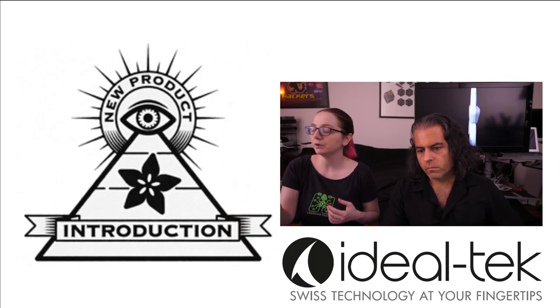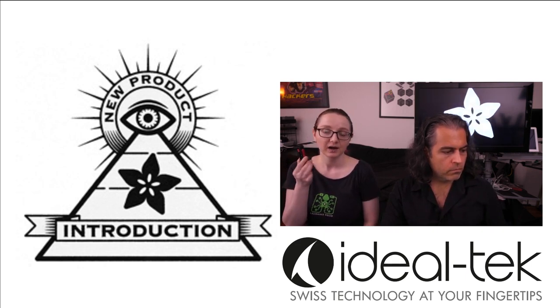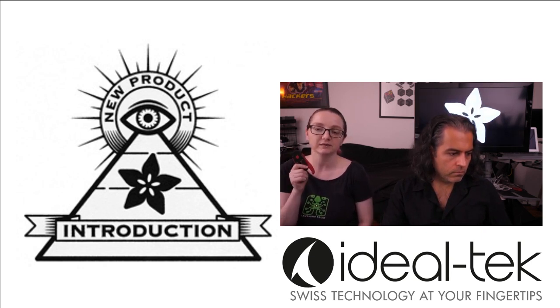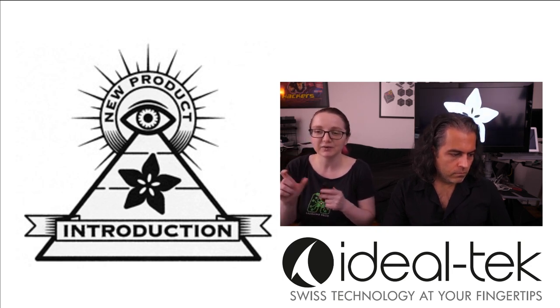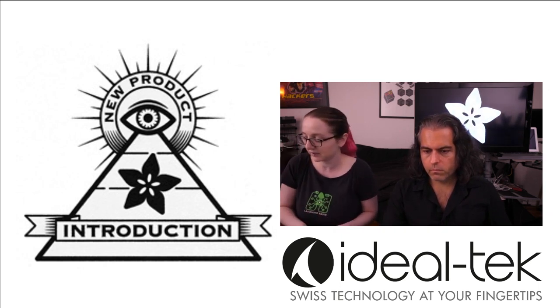I don't know if I would use this every single day just because I'm so used to the other kind of wire stripper, but if you're doing very precision wire stripping, I think you definitely want a special tool for it, because it's very easy with those fine wires to accidentally nick them or not be able to get the cover off. And then you keep stripping the wire and spending like 4 or 5 tries just to get it right. When if you have the right tool, you just do it the first time.